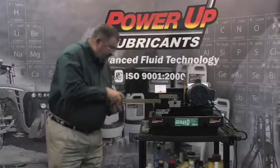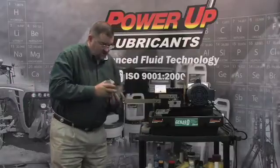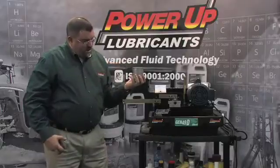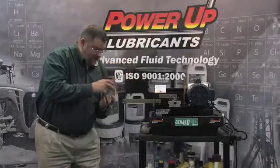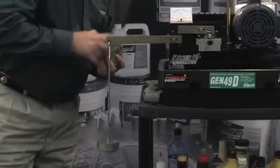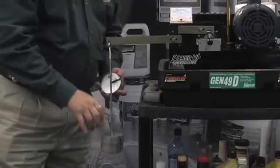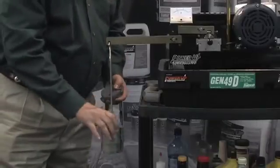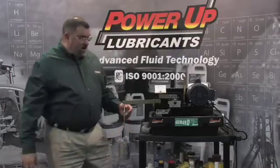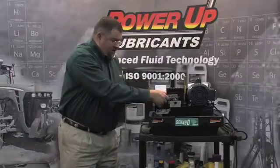We'll take the weights that we seized up: 6 weights we seized up with Mobil 1, 7 that we took for Slick 50, and I'm going to throw another one on just for good measure. And keep in mind, by rotating that bearing to a new spot, we're running on the size of a pinhead. The surface area that we're running on right now is very, very small.